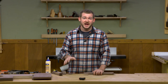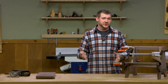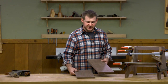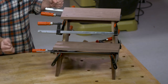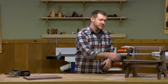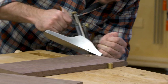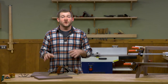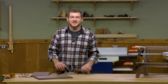Once all the tenons are glued in and the glue is dry, we can go ahead and get the final assembly done. Now that our stool is all glued together, really the only thing left is to wait for the glue to dry and take care of the treads. The treads are simply cut from a piece of stock in two different sizes - a narrower, longer piece for the front tread and a wider, shorter one for the top. The plans call for a bullnose profile around three edges, but with all the angles going on I'll cut a bevel along them instead. Then it's simply done by driving a couple of screws up through the stretchers and into the treads.